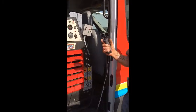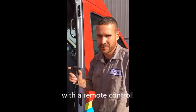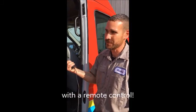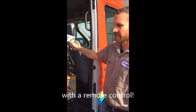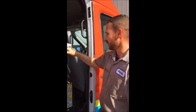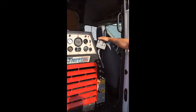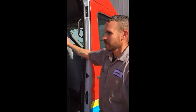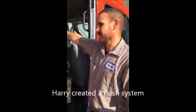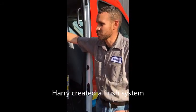You can walk away from it. There's also an option not yet installed — a remote control option where you can be 30 to 40 feet away from the truck and actually engage it with a key switch. Whichever hose reel you're set at, it's going to work that hose reel. Also, you have your automatic pump-out control through here with a flow-back system and a flush system. The pump-out is one of the main components in a truck mount that's often overlooked.